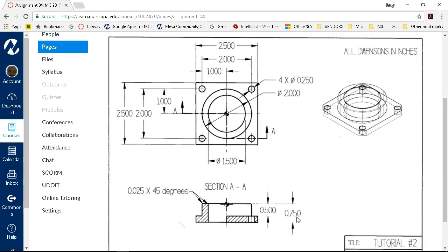All right, so until I have stock, or I've ordered the stock material, I'm going to go with, again, the assumption that the origin will be on the corner of the part. So they've drawn from the center point. Could go either way with the sketch based on the centers. Yeah, I think that'll work, and then we'll just move it back to the origin. Let's see, the bore is through. We have the steps to the outside,